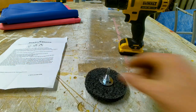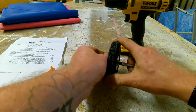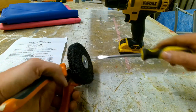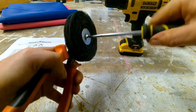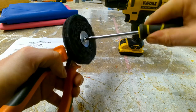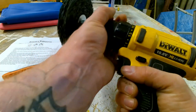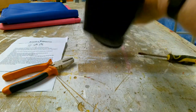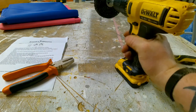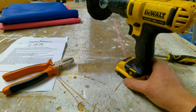Let's push this through — that's super tight. Then you put your grip bit on the top, twist it a little bit to get it pushed right in there. When you tighten the bolt down it'll go there. Usually tightening to the right — but like I say it's reverse threaded, so that helps it stop coming undone when you're actually using it. I'll get a screwdriver for this side and a spanner for that side and we'll properly tighten it down. Just use my screwdriver and pliers. Then you stick it in a drill and you get to go. I'm just using my small DeWalt because it'll be lighter — it's only a two amp hour battery. So let's go over to the chairs and give it a whirl.